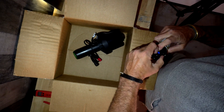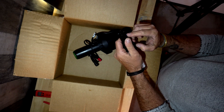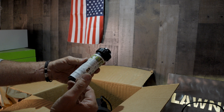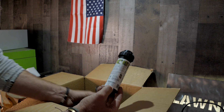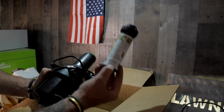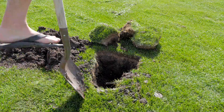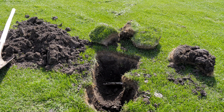When this head pops up, there's a single nozzle right here that's adjustable. You can change these out for different spray patterns, adjust them, and it's going to give you one throw that goes around. You can adjust the length of the throw pretty far — at 55 psi you get about 32 feet, which is about the same as the Rain Bird. But you're getting considerably more volume of water out of this head. I've already installed two of these heads down on my golf green below, and this one going up in the main lawn is going to do about 2,000 square feet on its own.